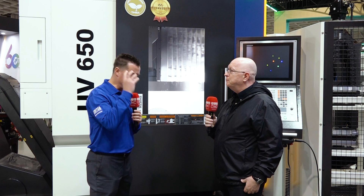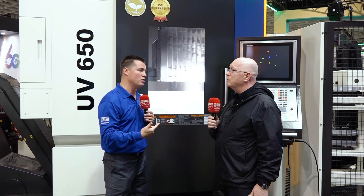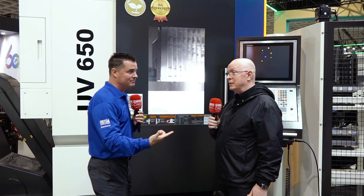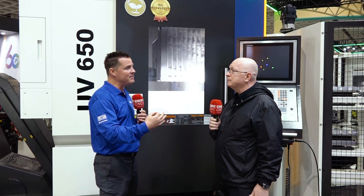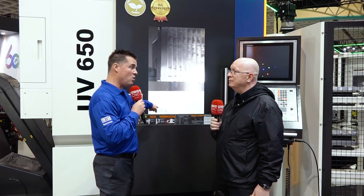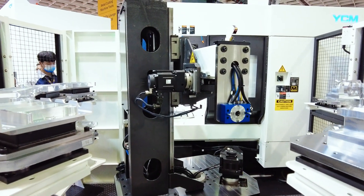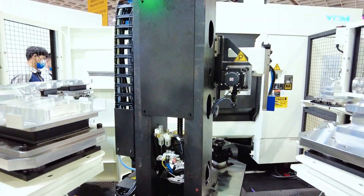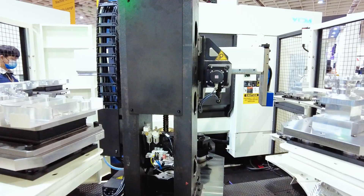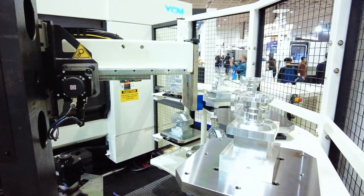Jeff, there's a topic of discussion I have to have with you — I want to go back to what you said about the tools. If I do my math correctly, you mentioned 120 to go on top of 60, so 180 tools. In a machine shop, I have been that machinist that wanted to have my done-in-one, to have that complex part finished, and I did not have enough tools in my tool changer. So regardless of the capability of my machine, I had to take it out, pop different tools in, re-probe them, or probe them ahead of time — I was making adjustments to my setup.